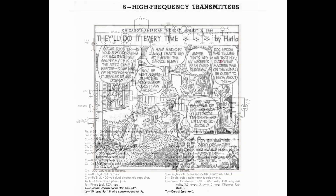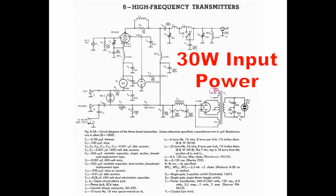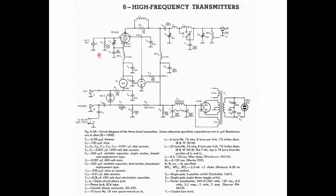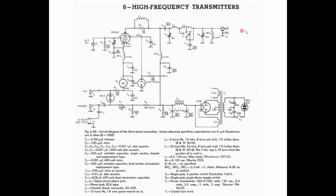Hence the need for shielding. Here we have the schematic and parts list of this little oscillator transmitter. This is a single-tube transmitter made popular in the 40s and 50s with tubes like the 6L6 and the 6V6. The 6DQ6 as an oscillator was a new idea — a power oscillator at that. They're running it at about 30 watts input power from the power supply. An oscillator doesn't have great efficiency, but with 30 watts input we might get between 10 and 15 watts out at the output.